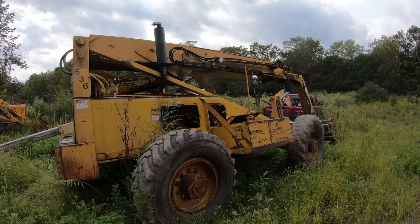So there's another injector here that's leaking, this one right here. So let's get that one replaced. Something interesting about this find, when this was running, I was trying to feel for exhaust leaks and I put my hand on the injector lines, the return lines here. This one felt like it was knocking a lot. It was almost moving the fitting. It was just violently knocking. The rest of them felt smooth.